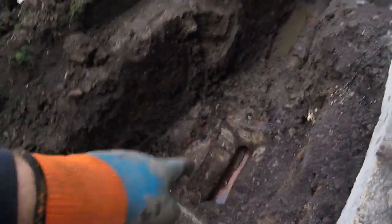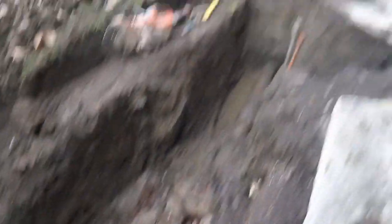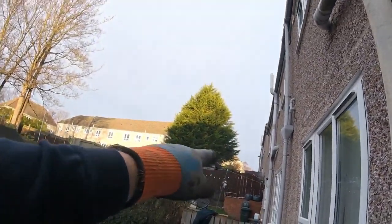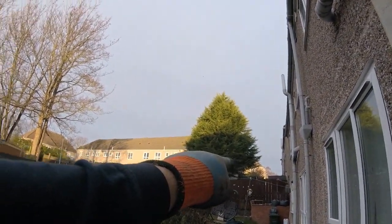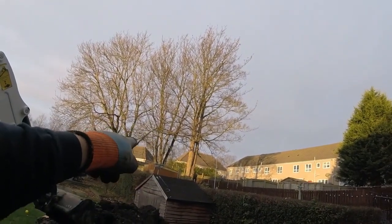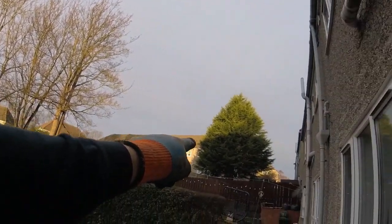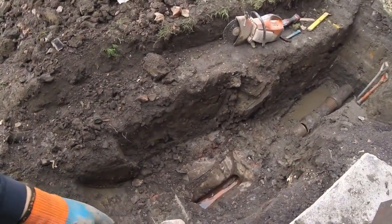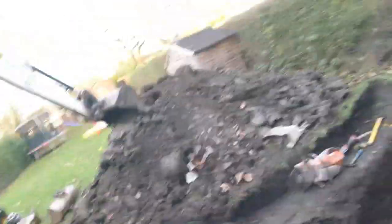Typical — I've just missed it. It just started running quite heavily from the six inch pipe. It drains the backs of these houses, and there's a change of direction next to that trampoline. It goes all the way along there and drains them houses. So when people flush their toilet all at the same time, there's quite a bit of a rush. So when we do the connection, you'll understand why we need to do it the way we do it, and so quickly.